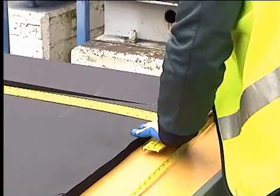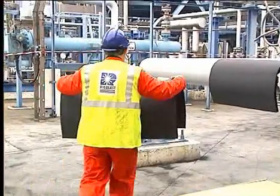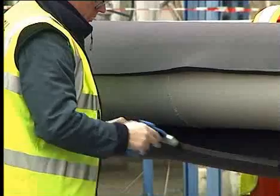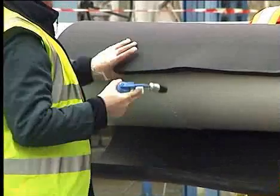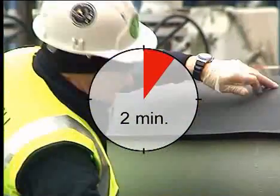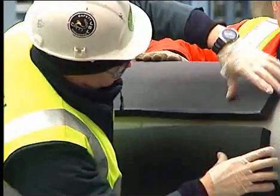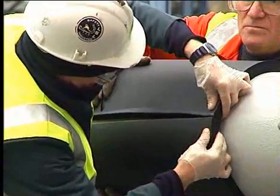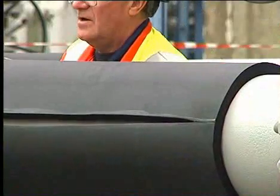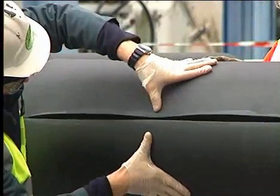To determine the circumference of a pipe when using sheet insulation, put the Armaflex strip around the pipe and mark. Do not stretch the strip. Cut the mark and check the size. The strip should meet at the inner point of the thickness of material and should be movable. Transfer the size to the sheet using the measurement from the strip and cut length as required.